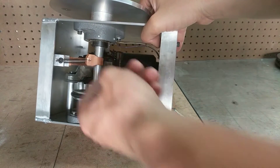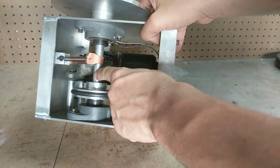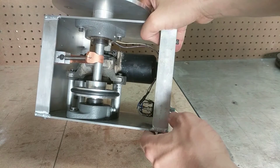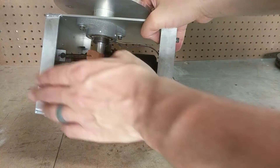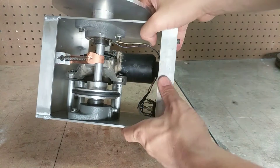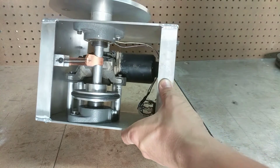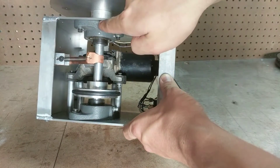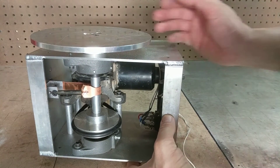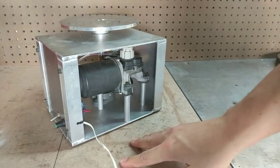This part is a little shoddy but it's what I had on hand — just little copper strips to ground the pulley shaft to the base and to the work table. The bearings are grease-packed and I don't want arcing, so it's a lot easier to just ground it straight through here, running right up into my little tabletop up here.